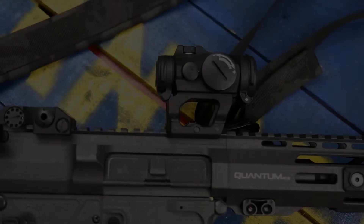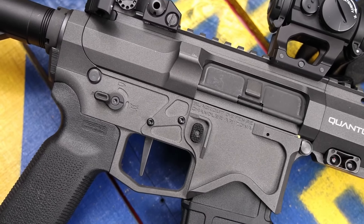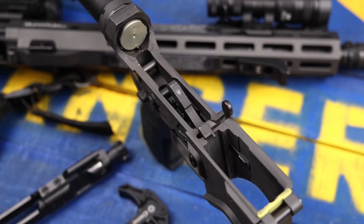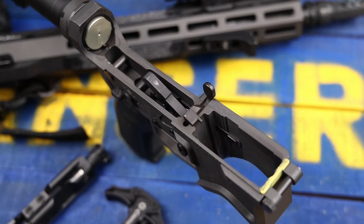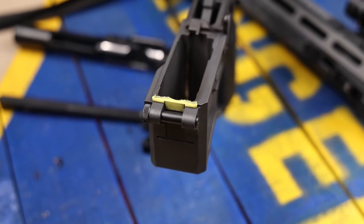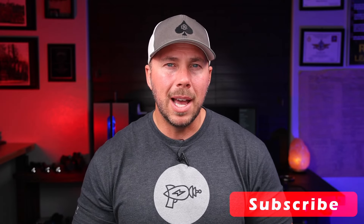When it comes to the look and the fit of the receiver here, these things fit super tight, and that's the way they are meant to be. There is that press lock technology in the front, and that's to give it another level of rigidity — although I don't really think they need it, it's just kind of an added feature. Upper and lower are super tight. Having something in the front that's going to lock that receiver in tighter is definitely better than having a set screw up under the pistol grip, which could cause carrier tilt and some abnormal wear. You're sending the upper receiver at a weird angle by putting a set screw up underneath that rear pin section where it locks in. Tightening it up at the front to keep everything working linear through that cycle of operation is definitely a better way to go about it.